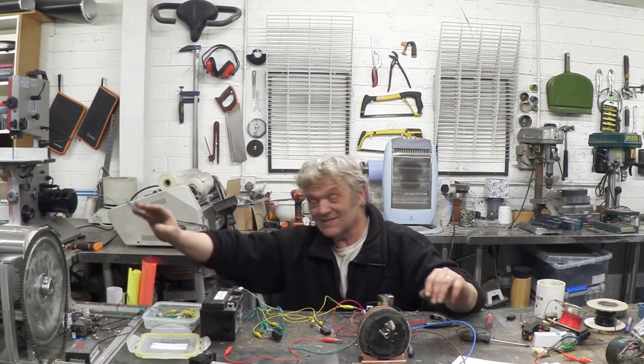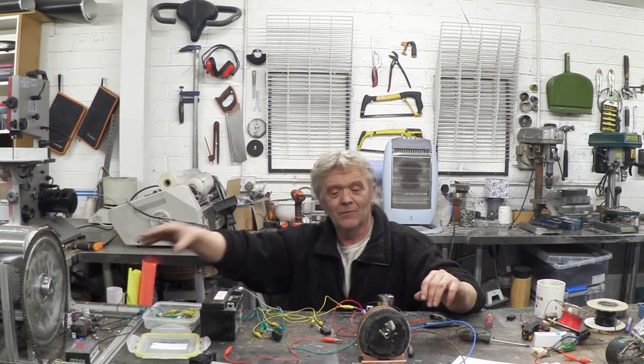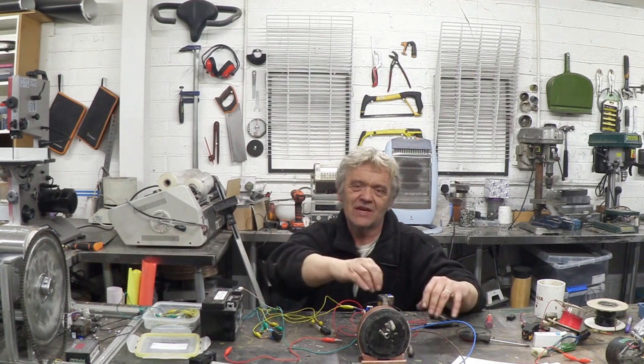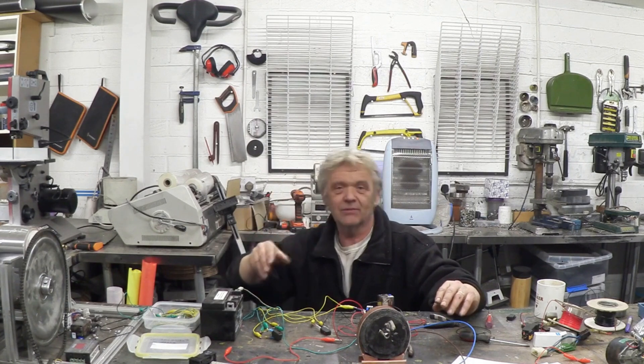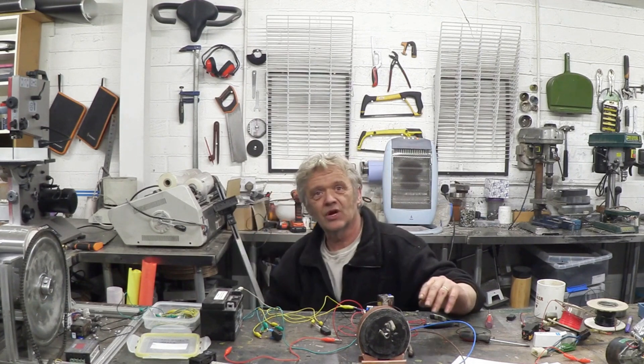You see the motor jumping because of the sudden braking and because it's not fixed down. That circuit in its totality will do exactly what we want it to do. We've included braking on the relay for safety — if the power dies this will stop without juddering forward, it will stop immediately. We covered that in the electronic braking video that we did using relays.